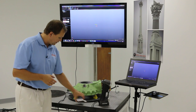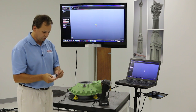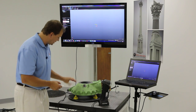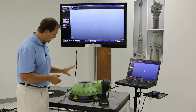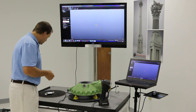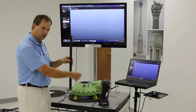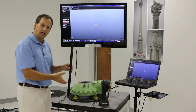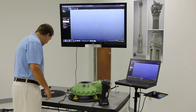Targets come in different formats. This is an aluminum part, so I'm using sticky targets. They come in a box like this, self-dispense — I just pull down, grab a target, and place it on the part. On a small part like this, you need targets about every three or four inches. On something bigger and flatter, you might get away with larger targets. We also have magnetic targets. Sometimes with a small or long skinny part, I'll fixture up some target bars around the part, and as long as the targets are in the line of sight, the scanner will pick up the part shape.